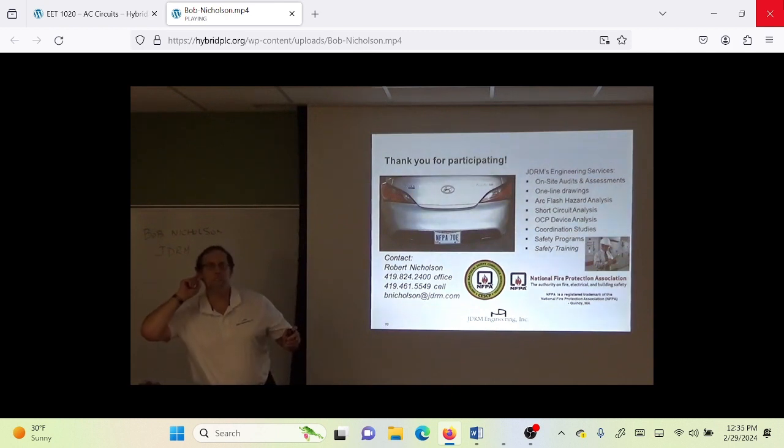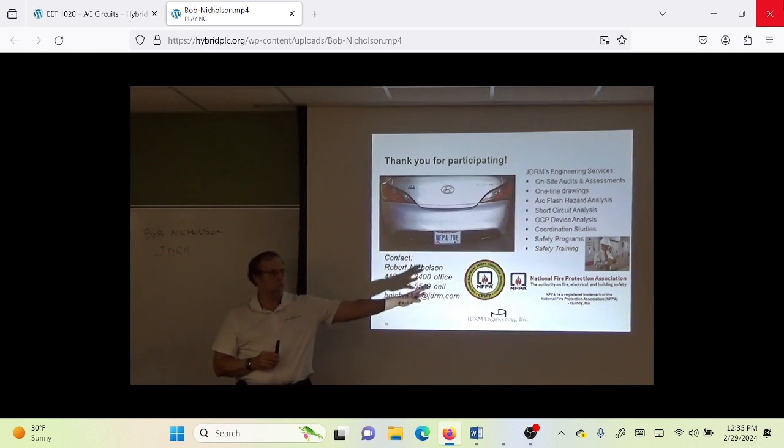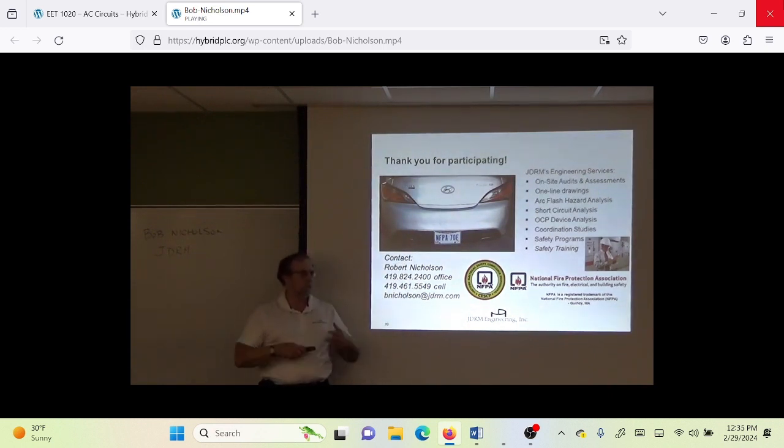I think you said it right. Physically smaller. Smaller wire. Yeah, okay. Smaller gauge wire. Higher voltage, smaller current, smaller wire. So the wires that you see in that substation are about this big around. The minute they come in this building, the voltage goes down, the current goes up. Now you have to have five sets of wire this big around because the current has changed. So that's why high voltage wires, because the voltage drop is one issue, and the other because of the current. They want to run it up as far as they possibly can.